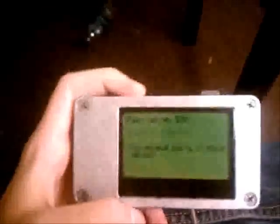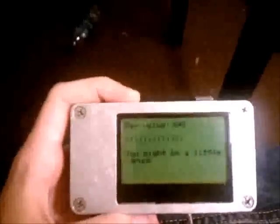And so when you blow on it and you've got alcohol in your breath, the alcohol hits that sensor and is vaporized and turns into acetic acid. And then the acetic acid changes the resistance of the semiconductor, and that's seen in the output pin. So that's what I'm using to tell.